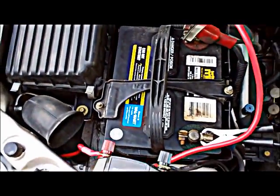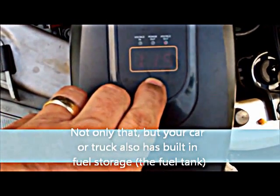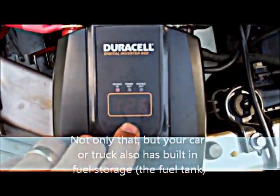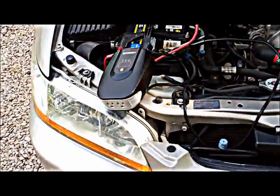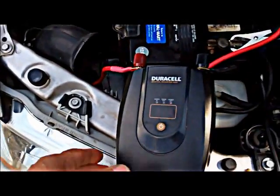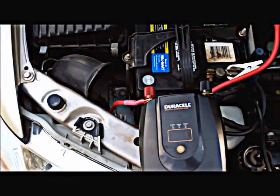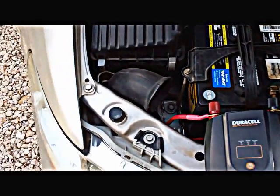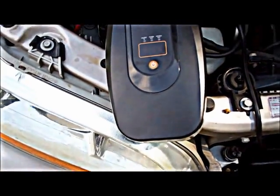Put a Y or a three-way on it and run to some critical things in your house — just an easy, simple way to have power. My battery is at 12.8 on my car and the voltage out is 115. If you don't go with the batteries, don't go with everything else — at least I think a person should have an inverter they can use off their car. If I'm not home and my wife needs power, she doesn't have to go out and try to pull on my generator because it is tough even for me to start. All she has to do is clamp this on — red is red, black is black — pretty easy to follow. She can run an extension cord in the house and run some things.